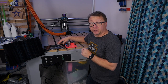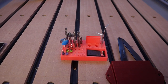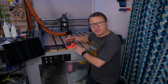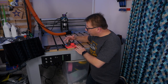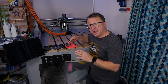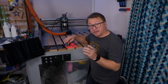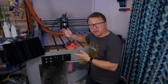The second accessory that I think is essential to CNC work is something to hold your bits and other components. This is a bit holder that I created many years ago for my original Shapeoko, and it has proven the test of time — I still use it today. It has a place in back for quarter inch bits where I store my V cutters, more quarter inch storage up front, and on the front I have eighth inch collet bits organized by size, smallest bits up front, then sixteenth and eighth inch bits.